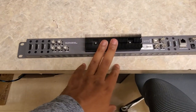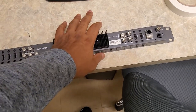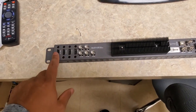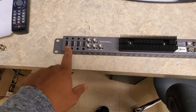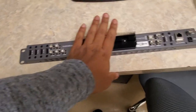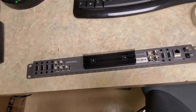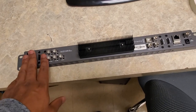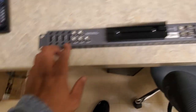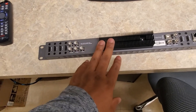This is the original ATEM and it didn't have any active cooling on it — it was left on and burnt out. If you ever have one of these and some ports stop working, that's kind of a fail-safe when it starts to get warm. I've experienced this before with other churches too — connections will start to stop working because it's overheating, and once you cool it down it starts working again. Our USB stopped working, you can't update it anymore, and inputs three and four stopped working. She's served us well but she's on her last leg.